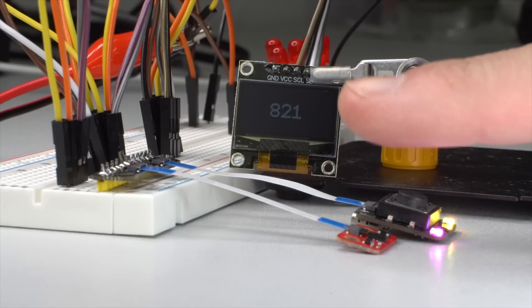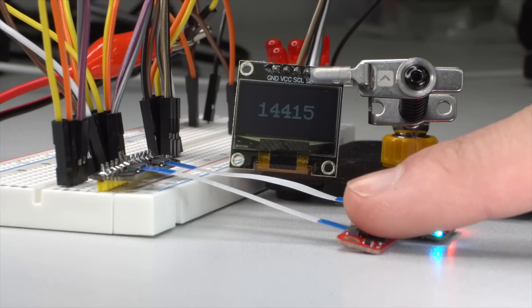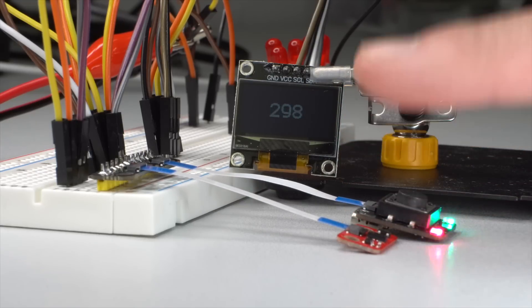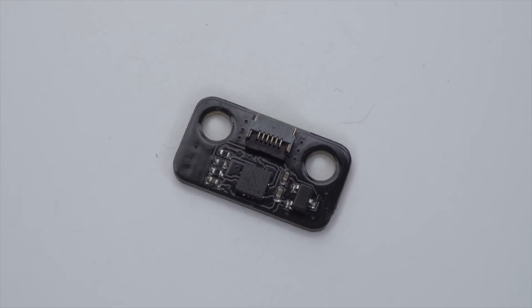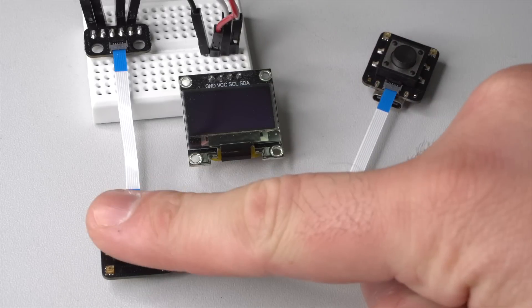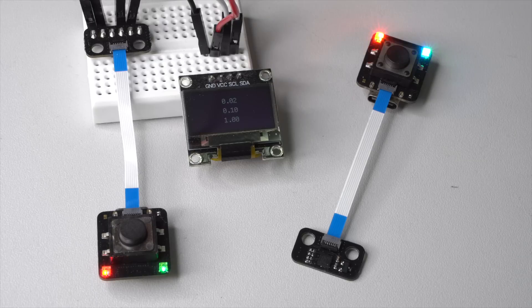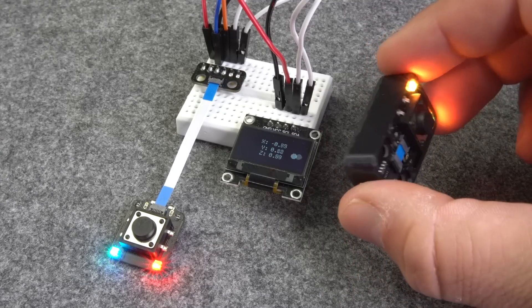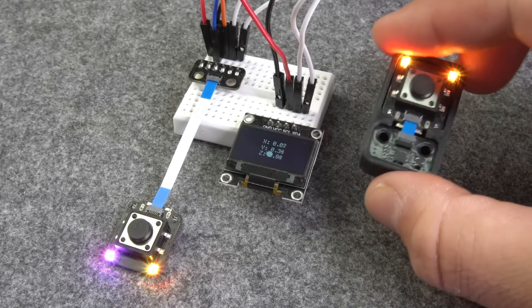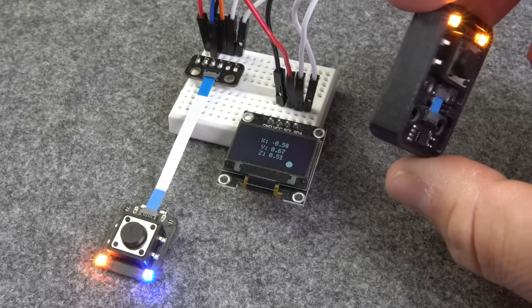For more information on this, you can watch my last video about the PicoClick C3. The next extension board is equipped with an acceleration sensor — I already showed this in the last video, but it has to be present in this one as well. It measures the acceleration in 3 directions, and with the help of Earth's gravity you can utilize this to get the pose of the board. In the last video, I showed how this board activates a PicoClick by firing an interrupt on any motion, and that it only consumes 9 µA of current in this state.